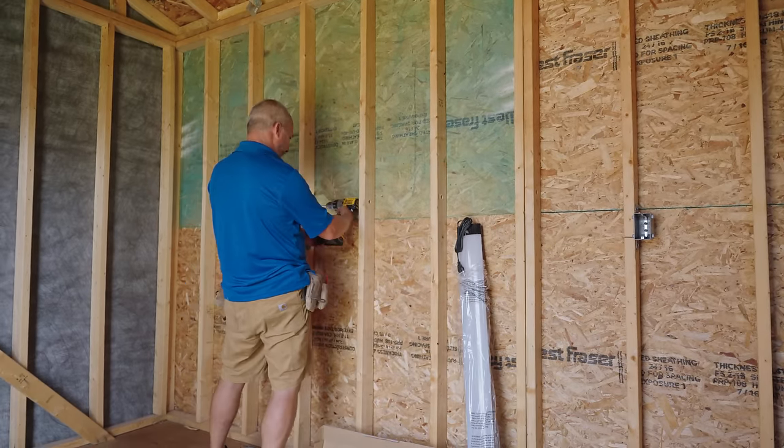Good. Now, cut them all relatively the same length. This is a really good example, guys, of why when you're not an electrician, doing your own wiring, you want to have a process. At least complete a box, staple in everything, and then complete something and staple in everything. Or you're going to make little mistakes everywhere you go, and then you go to plug something in, nothing works. You've got to check every single location, right? All right. Last plug, and then we'll get to our power supply.